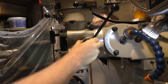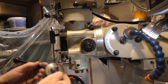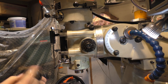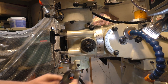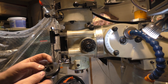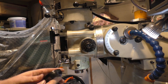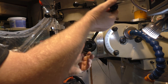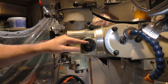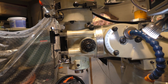So this kind of handle works great. This design has a single pin, and there's a ball bearing supposed to keep it in place, but there's not much tension — it probably needs to be increased with the set screw. Also, if you watch Keith Fenner's video reviewing this very product, a bunch of his holes got damaged in the common locations where this thing normally seats. His most commonly used holes are now oval-shaped, and the pin tends to pop out because it's just a single pin, so all the force is on one side.